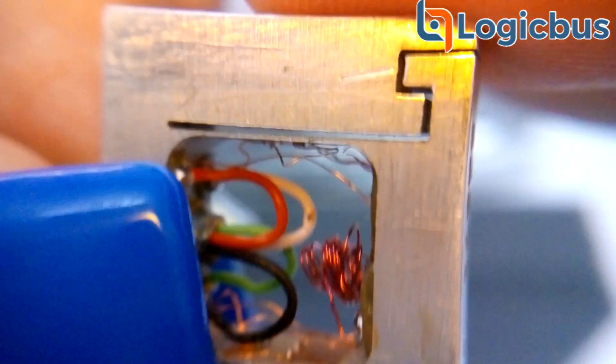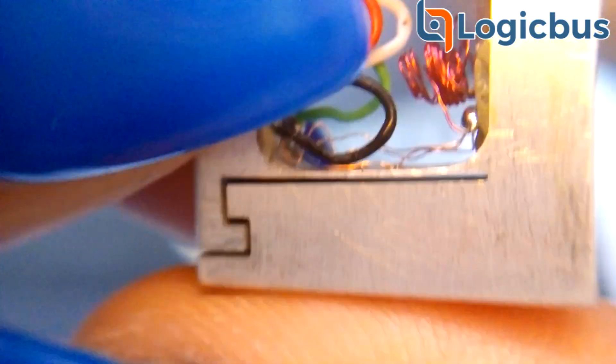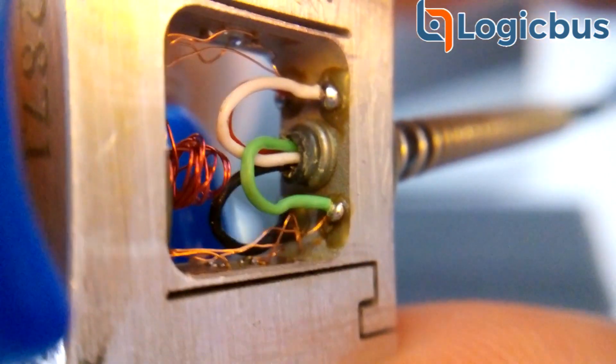Miniature-sized and lightweight, it's available in loads up to 100 pounds or 445 newtons. Inside the cell, we can see the black and red excitation wires and the white and green signal wires. On its top and bottom, we have its thread, which varies in diameter and dimensions from model to model.